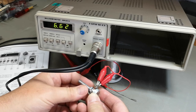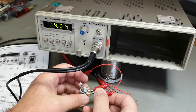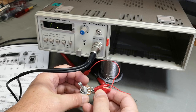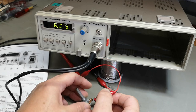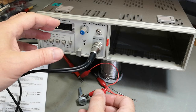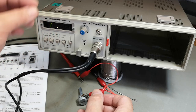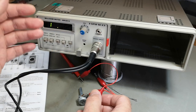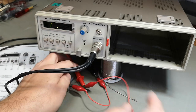So you can really easily see if you're pinpointing something. So this is the tone you're going for, right? And then you go from one circuit to the other circuit. So you don't need to look at the value here. And also, if you're comparing stuff, value doesn't really matter. It doesn't matter what the value is. You want to seek a difference. So I kind of like it. I think it's quite interesting.